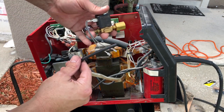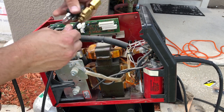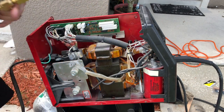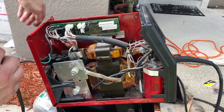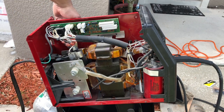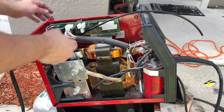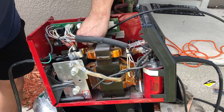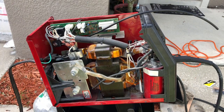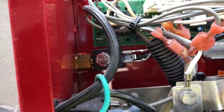Next, it says to install the 22-inch plastic tube to the solenoid, so here we are. The next thing is there are two screw holes on the back of this — those want to go through these two holes that are just underneath the circuit board. They're slotted right over here; you can stick this right through here. Have that female end of the solenoid going out of the back of the welder. Here are the two slotted holes I was talking about — you want that to stick out of the back and secure the solenoid with those two screws.